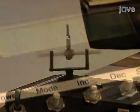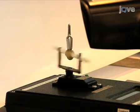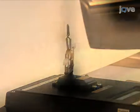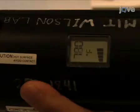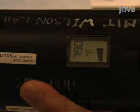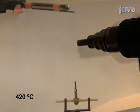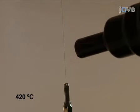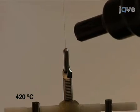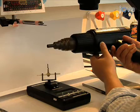Apply 80 clockwise twists followed by 40 counterclockwise twists to the wire bundle over the course of approximately three minutes. These parameters can be varied according to your needs. After tetrode twisting is completed, fuse the wires together by heating from three different angles with a heat gun using medium to low flow. For each angle, begin one to two centimeters below where the wire bundle splits, then run the heat gun down and up at a two centimeter distance from the wires for about five seconds. Use caution as high temperatures will completely melt the insulation and lead to short circuits.